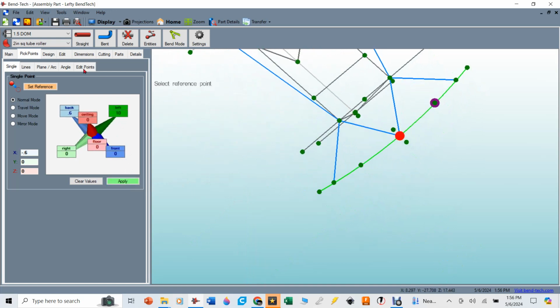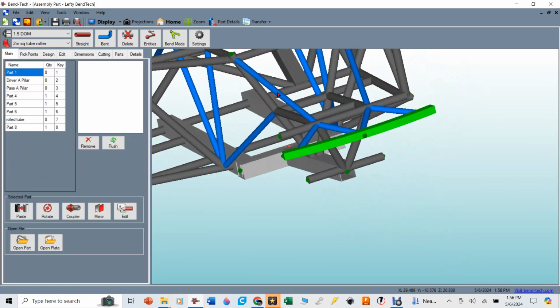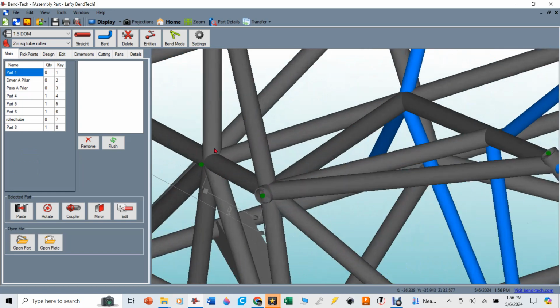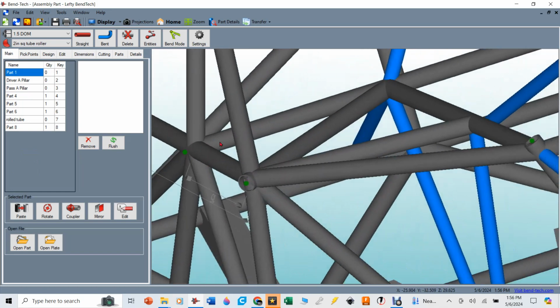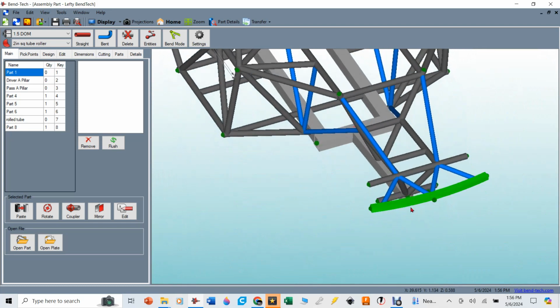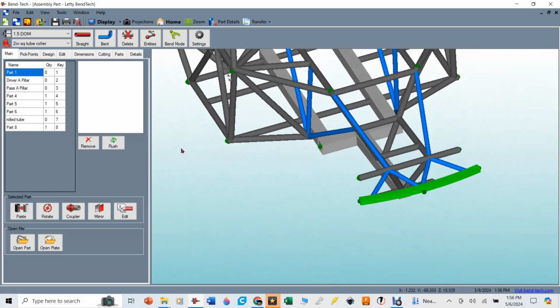Now, in general, whenever you are making a roll cage or something like that, you like to have nodes where, say, all the points come back, all their center lines come to one point. That's the strongest point on that roll cage. And on the front, I would like to do that, but the geometry just doesn't allow it, while clearing the lights, and also without looking too goofy, I think.